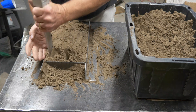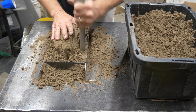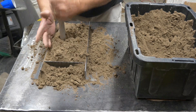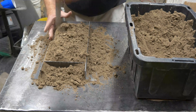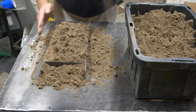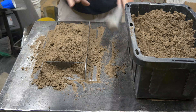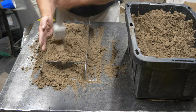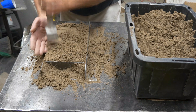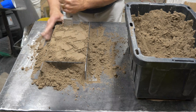This tool has no lip to grab sand — you can see there's not nearly as much sand squirting out of the sides. It's pretty common to want to ram around the outside edge first, just to hold things in there, and then go back and ram the entire area of the drag or cope — get it rammed down in there good and tight with the peen end of the sand rammer. I turn it over and finish it off with the blunt end, or butt end, of the ramming tool. This is just to finish packing it and give us a nice uniform pack across the top surface to get ready for striking it off.